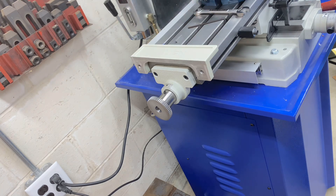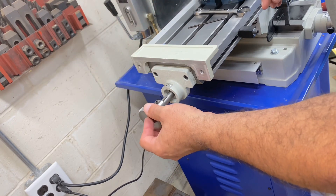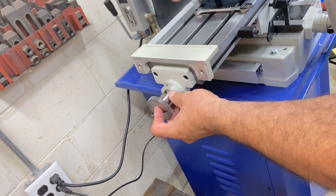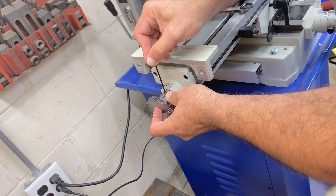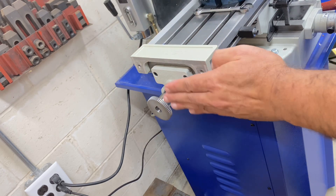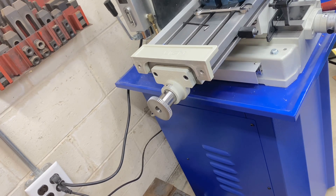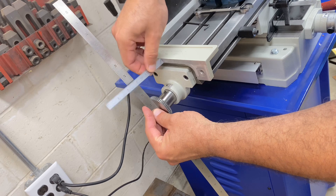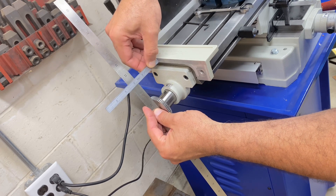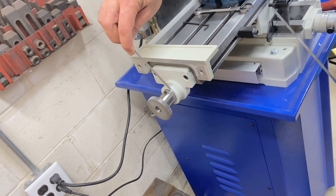You'll need to align it side to side when we start meshing the gear with the motor. Next, put your key in place and put the provided gear in place, and go ahead and snug that down with the set screw — just snug, because you might have to move it outward to line up and mesh with the gear on the motor. At this point, take a quick measurement and document it from this face to the back side of the gear. 2.7 is going to work — that'll give me a little bit of space so it's not rubbing against the casting.